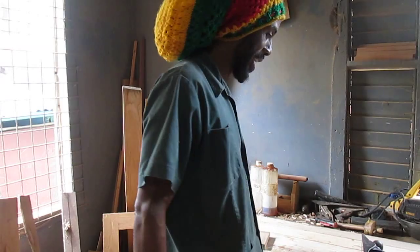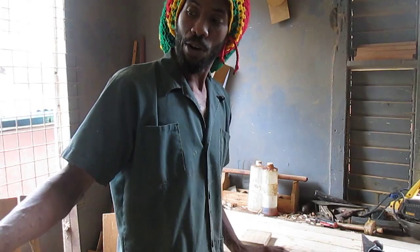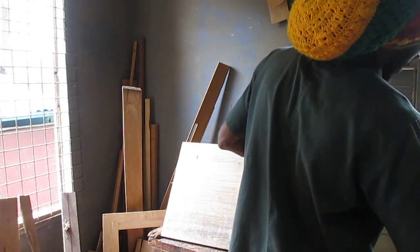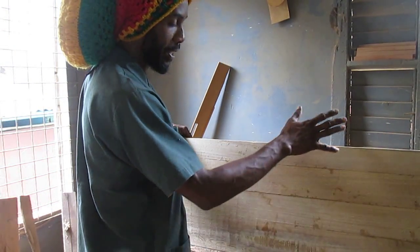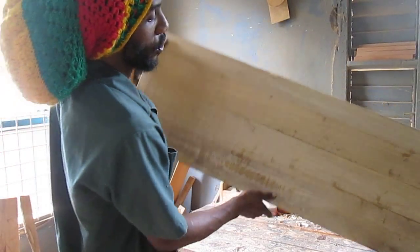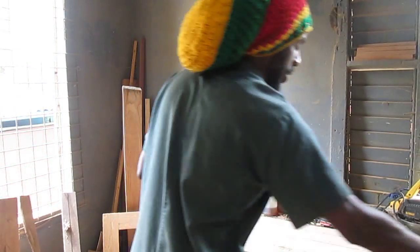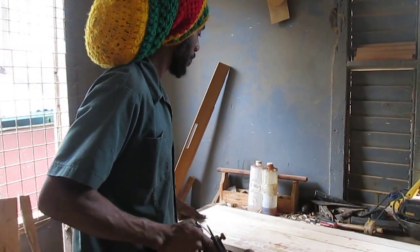What we're going to do today is level the top of this cabinet. When we put it together, we leave these little parts in so that you can see if something's not level. What you're going to do is traverse it with a hand plane — you're going to traverse it across.